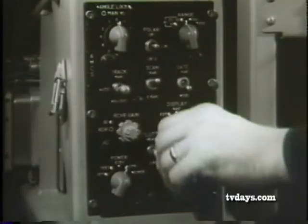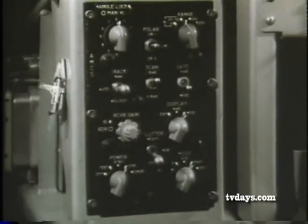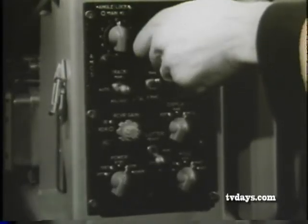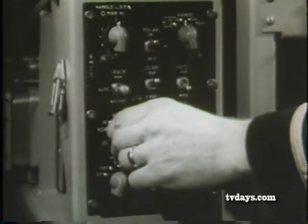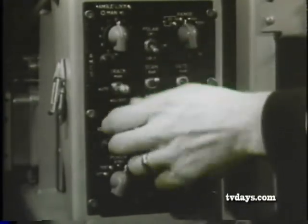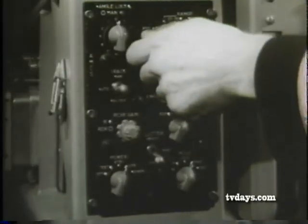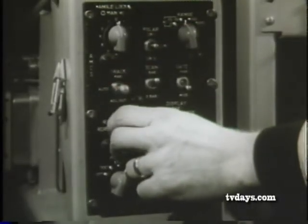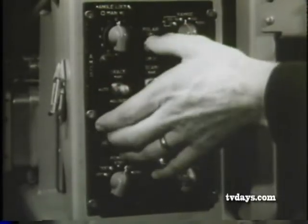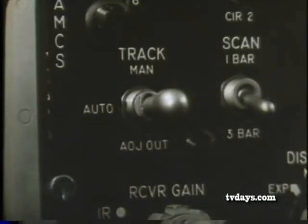Put the clutter switch in override to keep the receiver in the narrow band and to maximize your transmitter's power. Now, by trial and error, find the polarization that will further reduce the noise. Try circular 1 polarization, circular 2, and linear in turn. The target will usually burn through the noise at usable range.